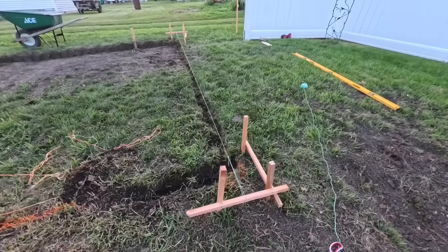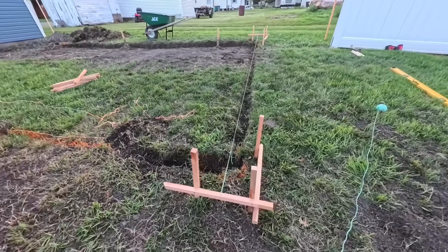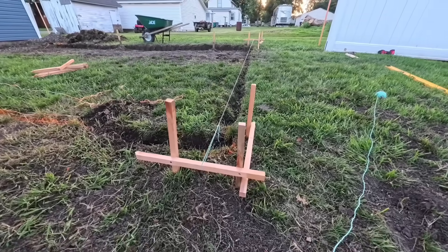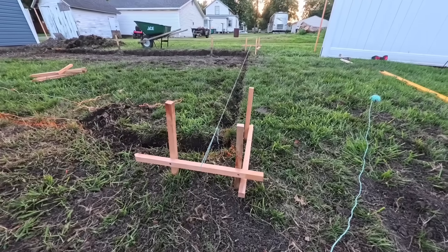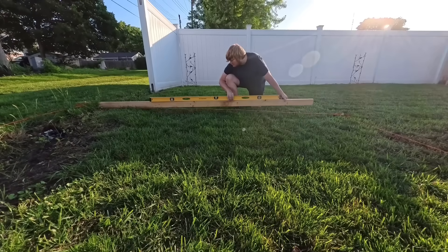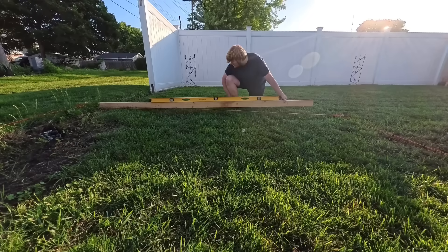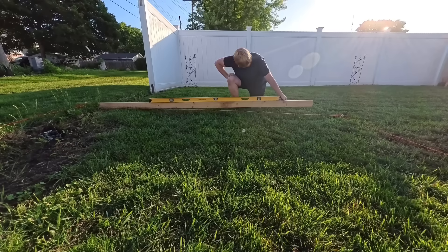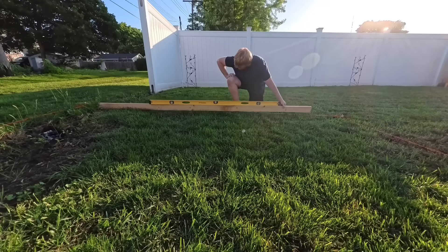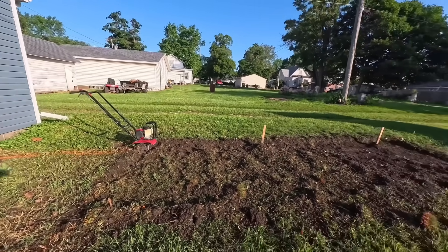Since you've taken the time to make your concrete slab perfect, you can make what is called a batter board — not only is it delicious, but it also allows you to move your corner markings farther away so that you have plenty of room to work without needing to refine the diagonal measurement again. My yard has a pretty steep grade. I can either have a lot of my concrete pad sticking up in front, or I can do a little digging to hide it in the back. I am moving enough soil to bury the back all but one inch so that drainage and heavy rains don't become an issue. If hand digging doesn't sound too appealing, you can use a garden tiller to level out your ground.